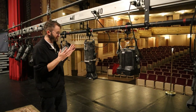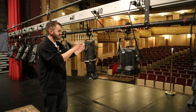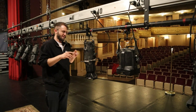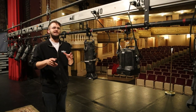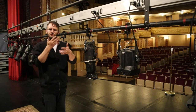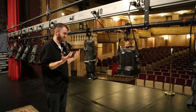The nice thing about lights like these — they're called ellipsoidals. The easy version is: up inside the lamp housing, where the actual lamp that produces the light lives, it has a reflector which is made of glass coated in aluminum, and it's an ellipsoidal reflector. So the light bulb sits in that little chamber, and every direction the light comes out of the lamp will be reflected out of this tube, maximizing the efficiency of the instrument.